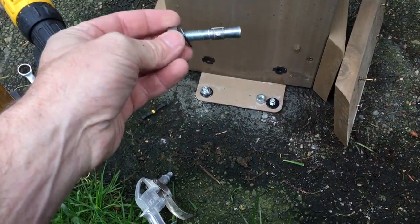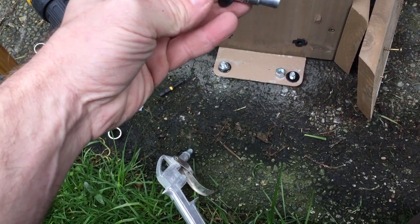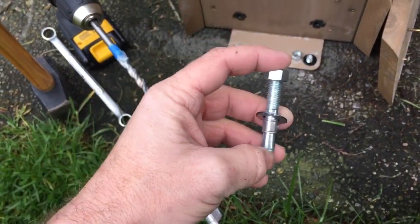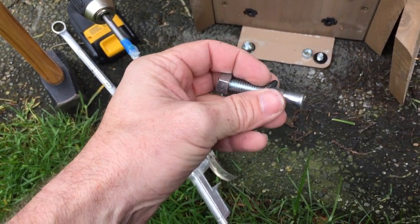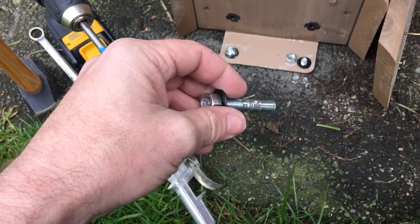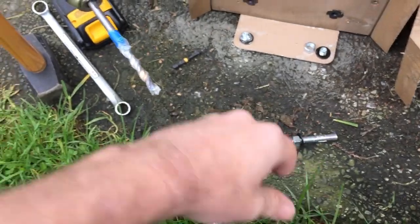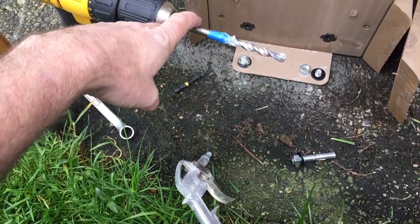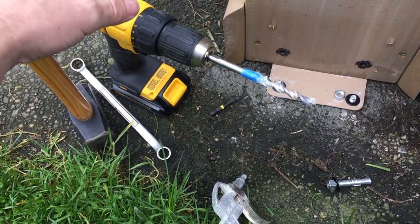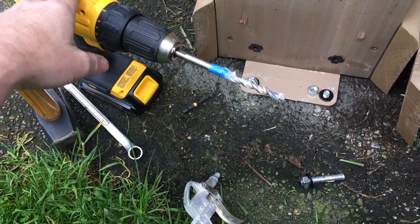You might go and do something different. What I went ahead and bought was 16 wedge anchors. These are 2.5 inches long, 3/8 bolt, but 2.5 inches long. I could have gone with something longer, but this has 16 points of contact, so I figured with that many, 2.5 inches would be fine. Basically what I went ahead and did was took my DeWalt drill, got a 3/8 concrete or masonry bit. I didn't have to use my hammer drill for this — I was able just to use my regular drill. You might need a hammer drill; I have one, I just didn't use it.